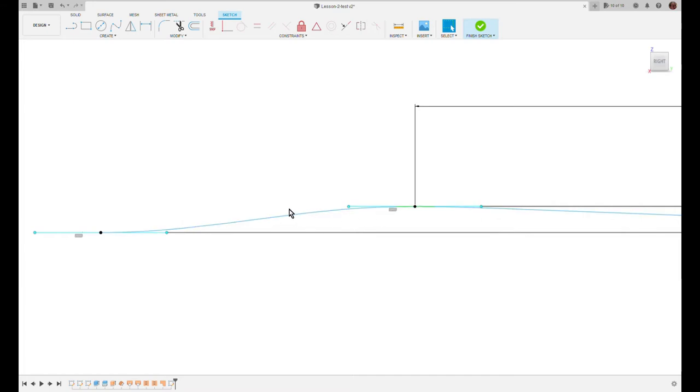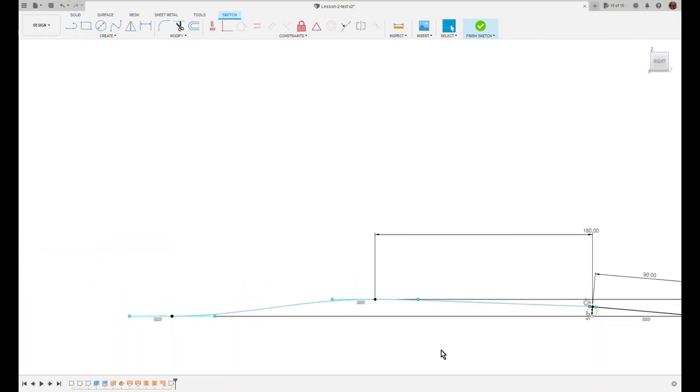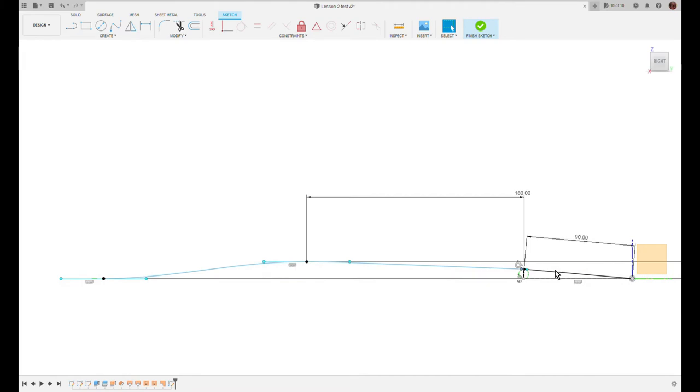If you want to have this shape more, you know, rounded, what I did is I add a line there, a 20 millimeters line, and then go from there to there. Or you can use arc. I suggest you watch the Austin Shanner video. They are great and really interesting, and they really teach you how to apply the constraint and to work with arc. But for the purpose of this video, I use the spline because it's really simple. So here is our profile. Our side profile, our neck plane, our pickup plane, and here is our shape for a curve. So finish sketch.